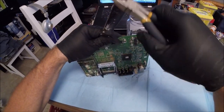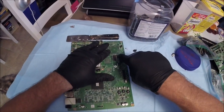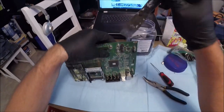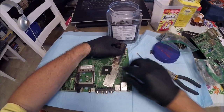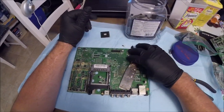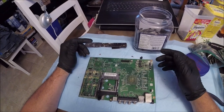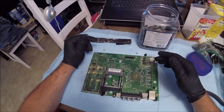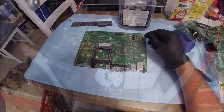I want to see how this one comes off — with the legs, I find it just breaks the chip more. You could just go like this, score it along the legs — it's so simple. I'm not sure what kind of yield comes out of these type of chips; someone said they're not that good, but I don't personally know. Anyway, that's all I want to show on this — you don't really need a heat gun. When you use one you worry about fumes, lead solder, you're breathing in lead. This method is a lot simpler — you're not heating the solder up.